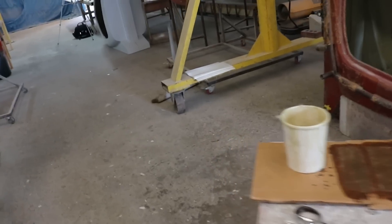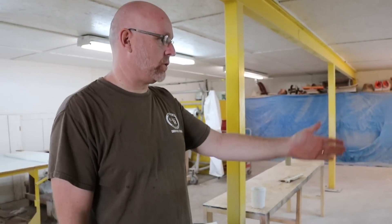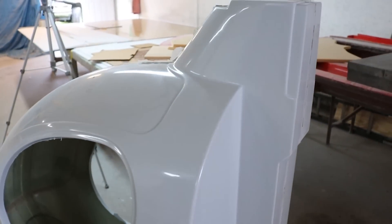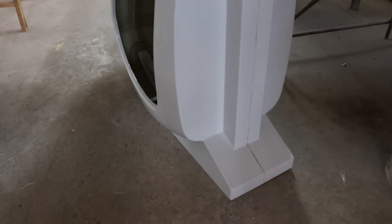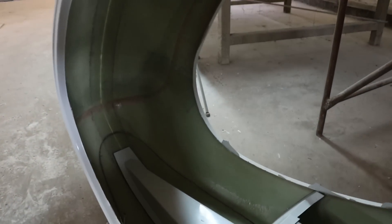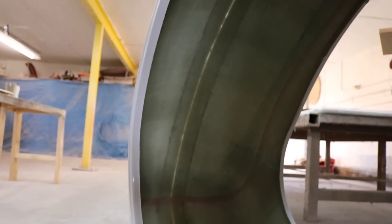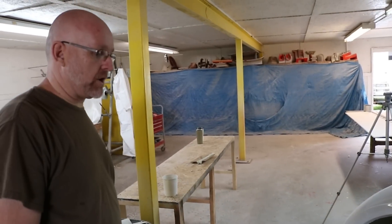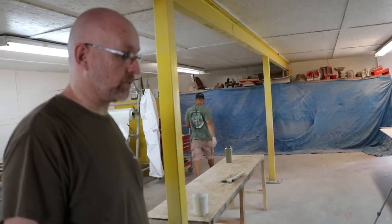Josh is laying up with some matte material, laying up one of these reinforcement structures. After that cures and all of the components are in it, we split the mold. As we split the mold, this is what comes out of it — unmolested after that. You can see we have some flash at areas where the mold shuts. It comes out with the gel coat already on it. There are a couple of little hand finishing steps we need to do, then we'll put it on our fuselage fixture. At this stage, the fuselage is not finished because there's no upper reduction mount assembly adhered to it, nor is there a fuel tank, nor is there a VIN associated with this machine just yet.